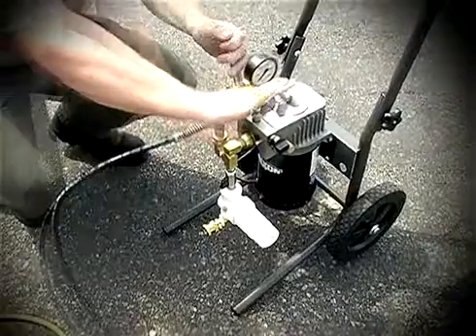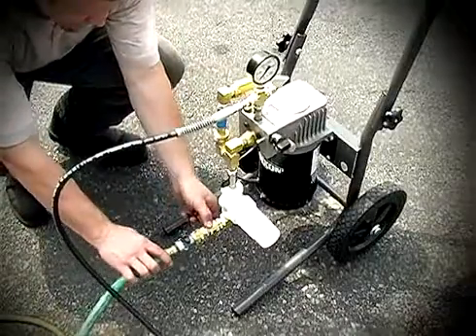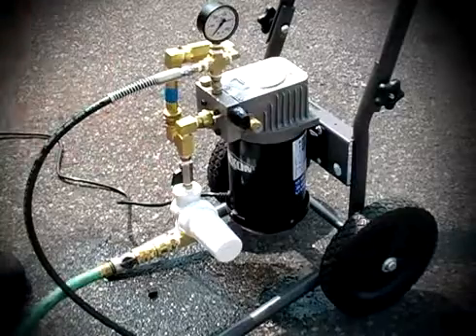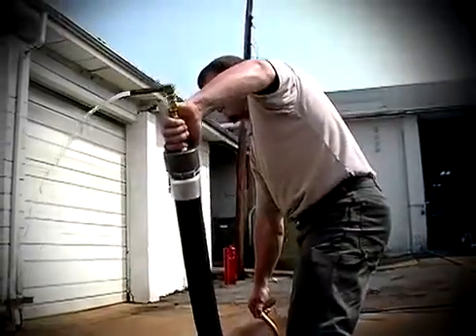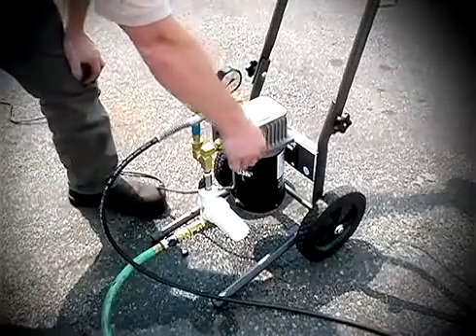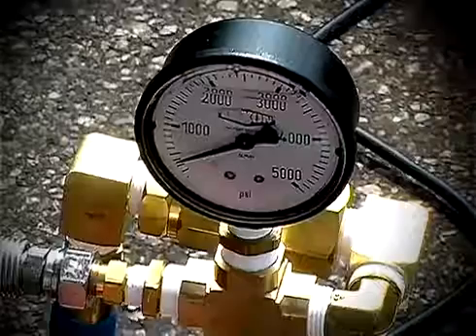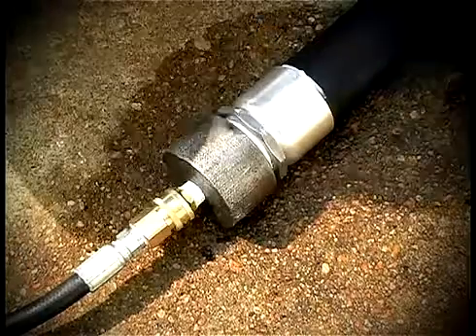Connect the intermediate hose to the pump. Connect the water line. Connect the power supply. Connect the intermediate hose to the test sample and open the water supply valve. Fill and bleed the hose as previously shown. Open the bleed-off valve on the pump to prime it for only a second. Then turn on the pump and turn the pressure knob clockwise until the desired pressure is achieved. This could take a few minutes due to the low fill rate. Hold the pressure and check for coupling movement and leaks as previously shown.